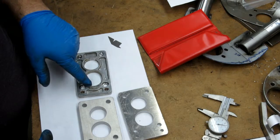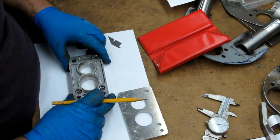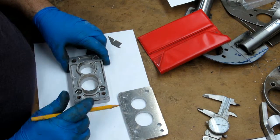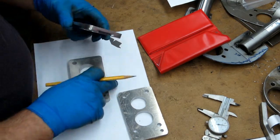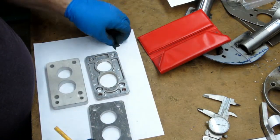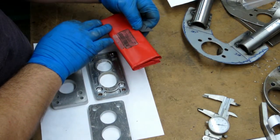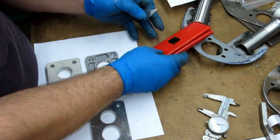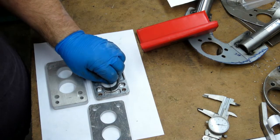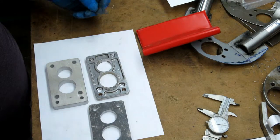shoot a little video. It's real easy to tell the holes match up and everything. The issue is how to put this bevel in here, what angle that's at. These two are the same thickness, so I can measure this angle. This is a part of this kit here, an 18-piece angle gauge set. Got it through Enco. Anyway, that's almost exactly 35. Really, really close.